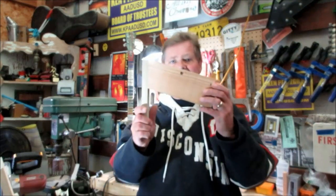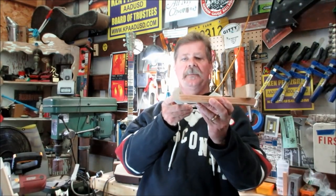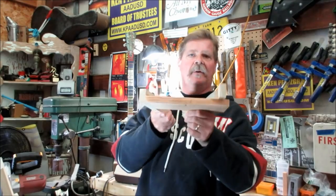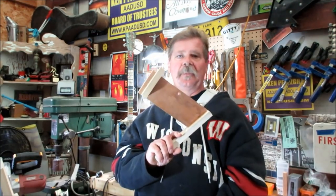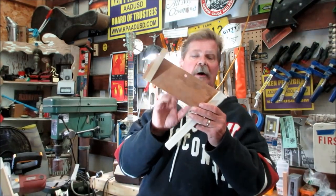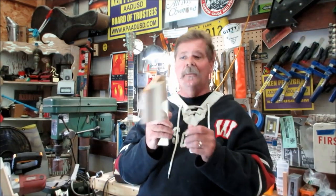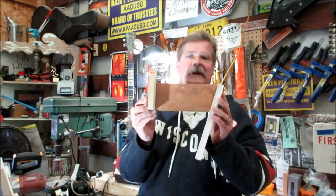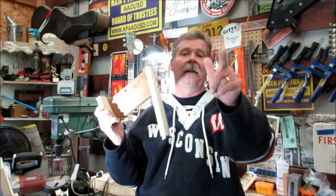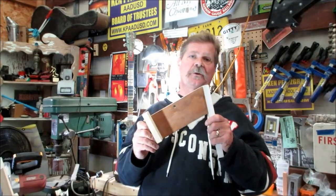Back to this jig — it's nothing new. What it does is let you set it on the table of your chop saw. It's got a 15-degree angle, and I've got this wrap-around so it sits on there and won't jump. If you look up Big Daddy Mojo's videos on YouTube, the first one of these I saw was a Dan Dukes model. Today I'm going to show you how to build this. It really only takes about 10 minutes — you'll wait for some glue to dry — and it allows you to crank out a lot of scarf joints on both neck boards and headstocks.